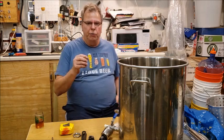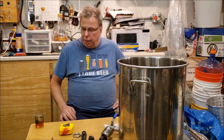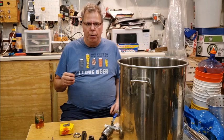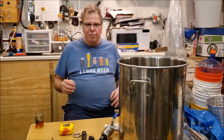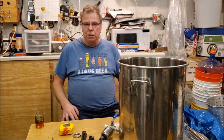So it would have taken me a fourth that time had I had the proper knockout punch of the right size for the hole. So if you're going to do this, I'd highly recommend either getting a good 1 1/4 inch hole saw or a knockout punch, and really the knockout punch is the way to go. You can pick them up, I imagine, for somewhere in the neighborhood of 20 or 30 bucks online for the 1 1/4 inch one. The set I have of 4 conduit punches really only cost me about 20 bucks, and I've used it a lot for holes in all kinds of kettles, but I don't think I'll ever do the step drill again, if I ever have to.